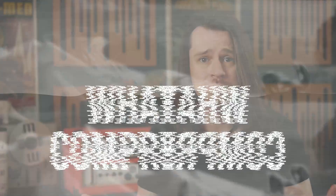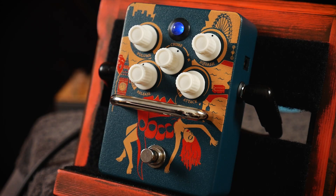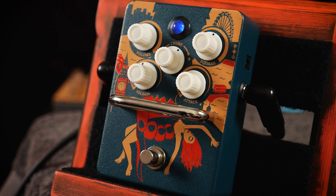Anyway, let's start with the basics. What the hell is a compressor? A compressor pedal will do two things for your guitar signal. Firstly, it will attenuate or decrease the level of any loud parts of the signal, particularly the sharp attack transients at the beginning of notes. Secondly, it will amplify or increase the level of everything else, granting longer notes more sustain before they die off. This effectively narrows the dynamic range of the signal, making the quiet and loud parts closer to the same volume level — just like you put the signal into a vice and compressed it.